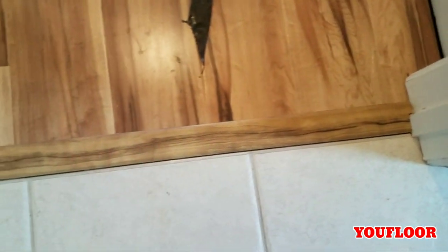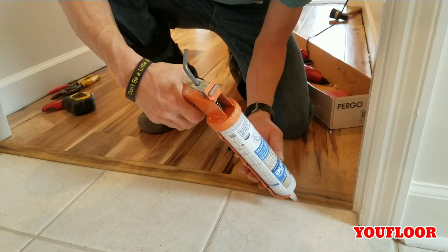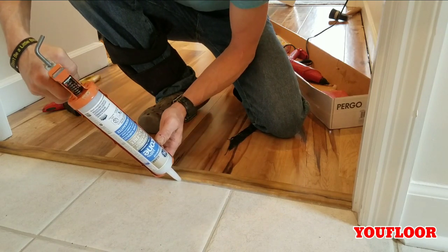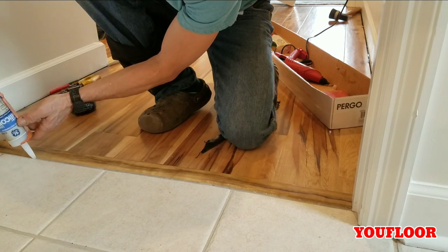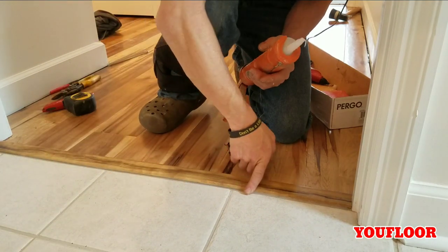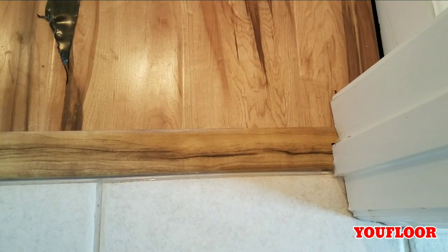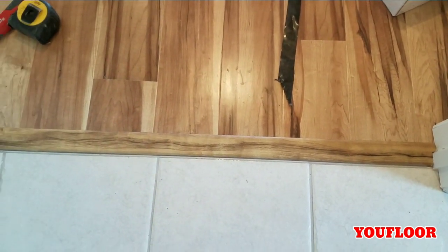What I like about the hot glue is that after about 30 to 45 seconds it's an instant hold — feels very solid. Almost done. Lastly, I put a very small bead of silicone in the crack between the transition and the tile to prevent any water from getting in and causing problems later. And there you have it — one transition installed against tile on concrete with no screws.